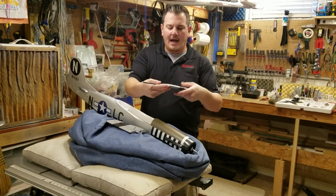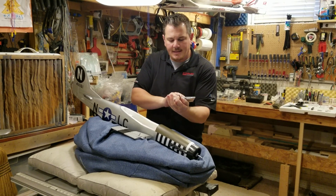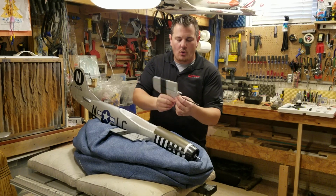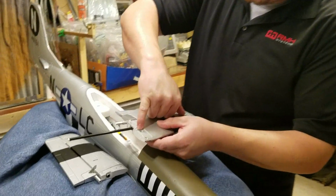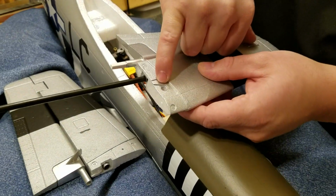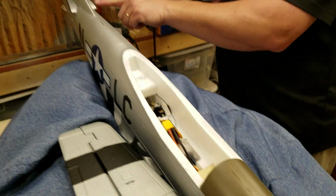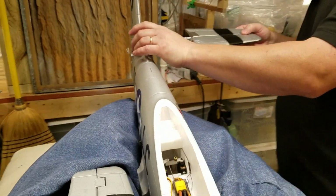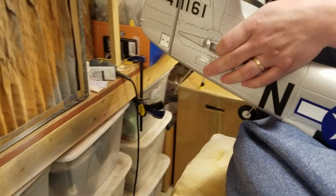The way you can tell up from down is by looking close at the print and also looking at the holes. So come on up here for a close-up, Esteban. The way you can tell that you're looking at the top is there's a relief cut into this side, whereas there is not a relief on this side. Also, it's molded so that it receives straight through here.